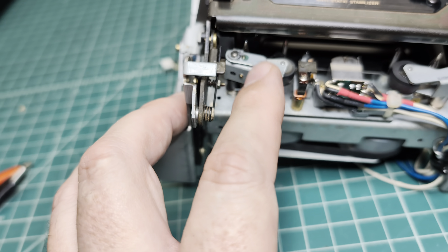Unfortunately, that's probably it for this deck. I will just tune up the electrical parameters, make sure it's tuned properly, and return it to the owner. The main point is the capstan probably needs to be balanced — because the surface is clean, I checked it with a cotton swab, there are no bumps, it goes smooth. The surface on the front is clean and good. We have a really good tape tangent. Everything is nice.